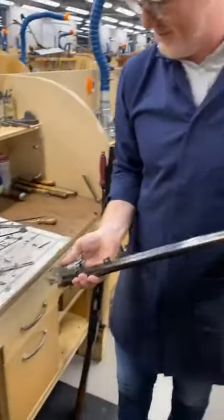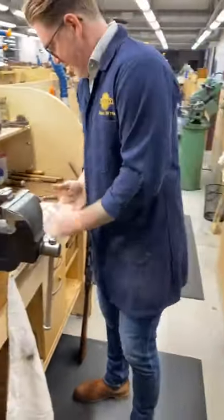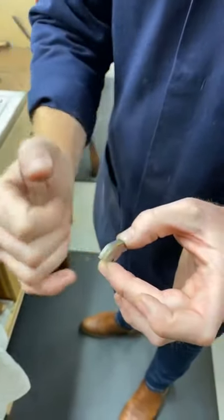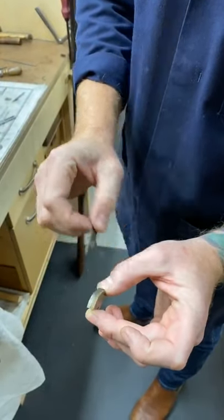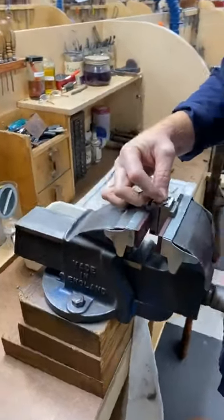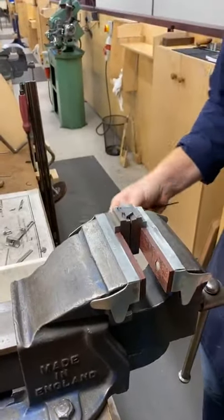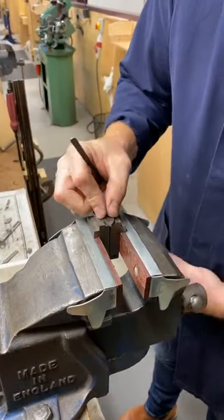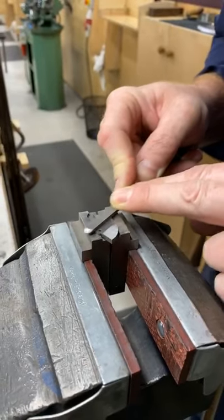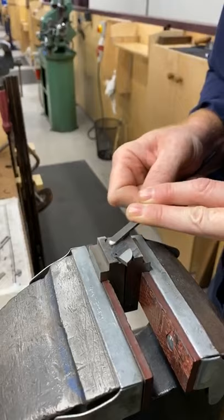Like I said, when we're fitting these up, that forend back, we'll start as a pair, getting like this, and we'll put them on the mill and give a slot for the center arm to go into. I'll show this later on. And also, we'll come into doing a bit of filing. At this point, it's all about filing and getting your even surfaces. Let me use the other one because it's not a good angle for the photos. This is all it is, filing flat, and trying to get a nice even surface over it so we can match up the surface within the forend.